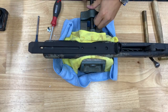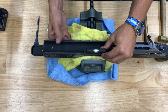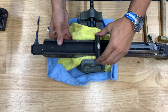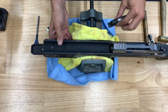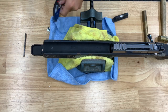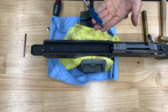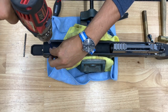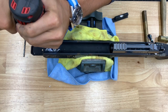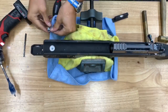Once you've got that done, go ahead and flip the stock over. I leveled the other side before we started, but now that we're flipping over I want to level again because I want this hole through the stock to be pretty square. We're going to get pretty close to level in two directions, then cinch it back down on the bench vise. Start here with the paddle bit — be very careful with paddle bits. This one has a little bit of a rake into it, which is designed to help it pull down into wood. Paddle bits are typically meant for wood as opposed to fiberglass. I just want to create a little bit of a countersink — the paddle bit will be self-guided, and I just need enough of the countersink that the T-nut is going to sit down in there.